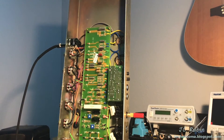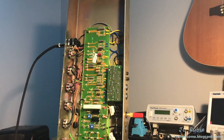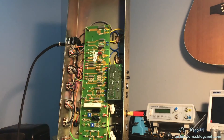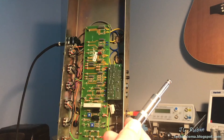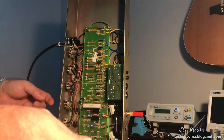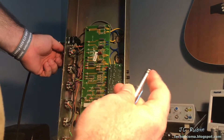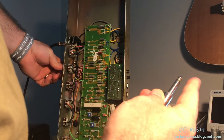Here's something I noticed right off the bat - a lot of crackling and crunching when it turns on. There's an example of that. Another problem I noticed: I've got an input here just floating and when I touch it, with the volume cranked, you can hear a terrible hum. And when I adjust the preamp control, there's no effect at all. I'm thinking something's floating in the preamp stage, but the amplifier stage is not affected by it - so it's isolated.